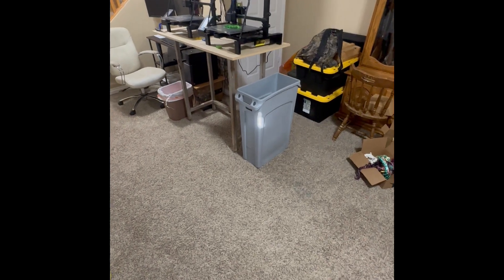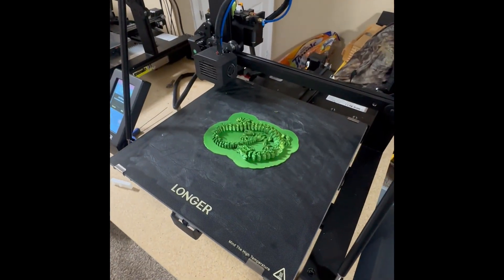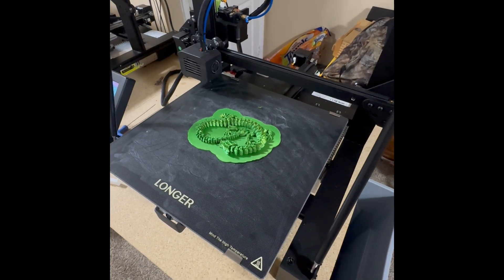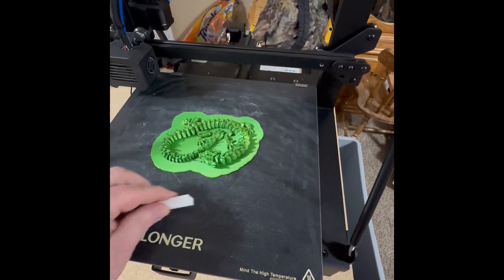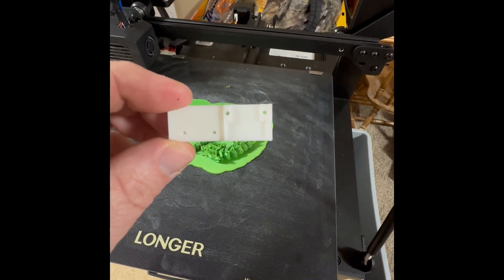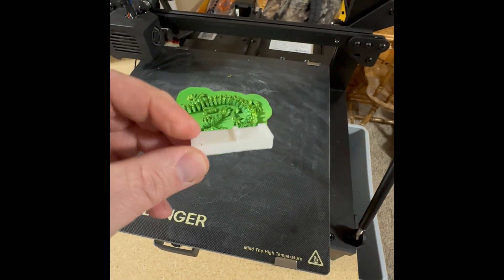So with what I'm doing, this is becoming a problem. I've gone through probably 15 or 20 of these filament sensors because they just flat out wear out. What we'll be doing is installing this block — it's got some recesses in it for the run-out sensor and uses the stock holes. So let me walk you through that.